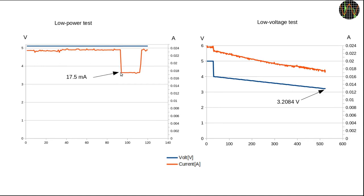I used the same method to verify how low the voltage can get before the TC66 stops working. I turned recording on and then lowered the voltage in 10mV steps from 4V down to 3V. The last recorded value was 3.2084V, but even before that, at around 3.3V, the display was already so dim it could no longer be read.